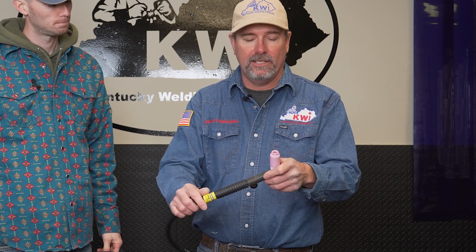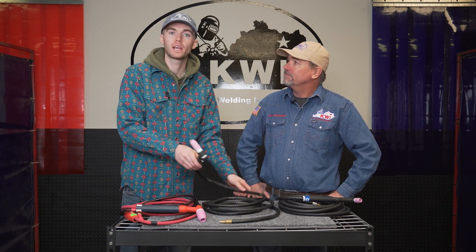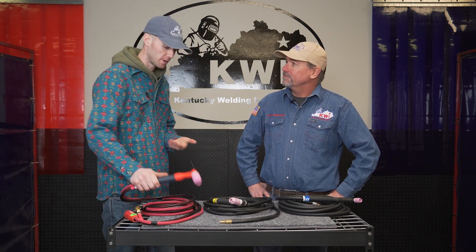If I'm running the 150 amp Profax or another 150 amp one-piece rig, I might creep up beyond that 150 amps — maybe 160 or even 180. But longevity-wise, if I'm going to be running 160, 180 or above, I need to move up into the 250 amp. For sure. On a two-inch socket weld, sometimes I'll use this rig at 200 amps, but you're only welding for maybe two seconds at a time because it's not that far. But if you're going bottom to top non-stop on six-inch heavy wall all day long — that's when you want the 250 amp. You'll burn the smaller rigs out.